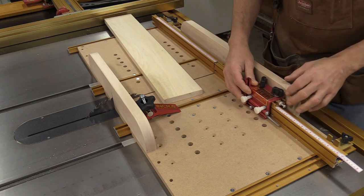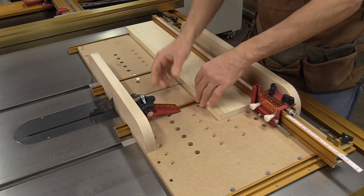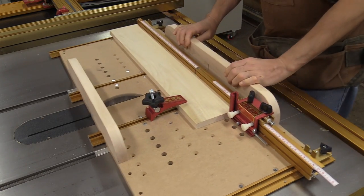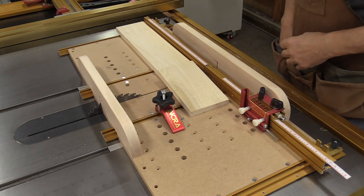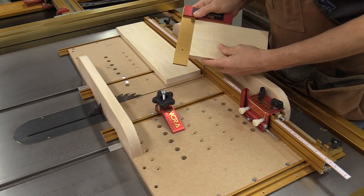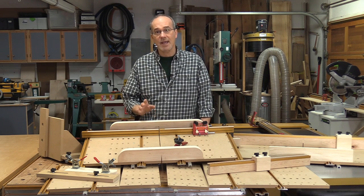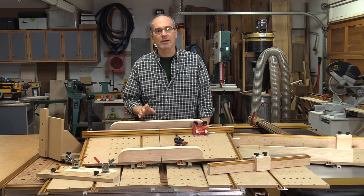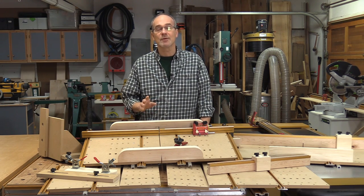Now I make a test cut at eight and one-sixteenth of an inch — lock the stop down, place the board against the fence, use the hold-down clamp, lock it down securely, and make the cut. After unclamping and checking the measurement, it's exactly eight and one-sixteenth. It checks out perfectly square. This sled only took about two hours to make and calibrate, and considering its accuracy, repeatability, and safety features, it's really fantastic. Using the Build-It system you can design and build jigs quickly to accomplish many different operations in your shop — so spend more of your valuable shop time building projects and not jigs. Try out the Incra Build-It system. You'll be glad you did. Thanks for watching!